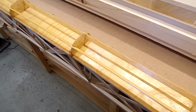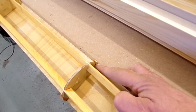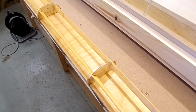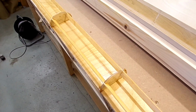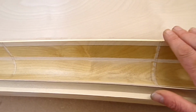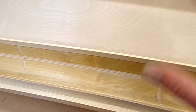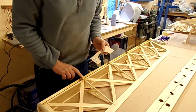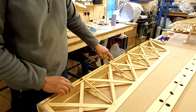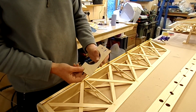So this aileron is now ready for me to sand the bits on the side here to shape. To which I'm going to make up a quick light ply jig, and then we can get this one bonded together. I can get this out of the leading edge form, then I can get the next one in. So for sanding up these edges, I've got to clean off just a little bit of where some of the varnish managed to make its way through to the bond area. That'll be easy.